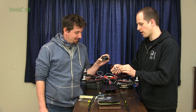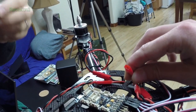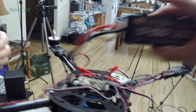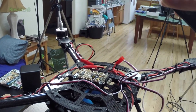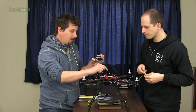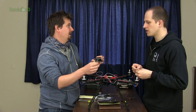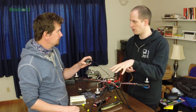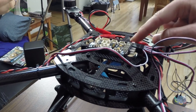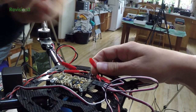This is a 3-amp switching voltage regulator, not a linear — nice and efficient. These little JST pigtails come out of our Dean's connector at the back. This is what gets plugged into our, in our case, a 3-cell battery, which is going to provide around 11.1 to 12.4 volts depending on how much charge we've used. We could just feed it the 12 volts, but it's definitely better to provide your sensitive electronics with a consistent source of power. So while this pigtail breaks off into different connectors going to our motors, we have this fifth one here free — so let's plug that in.